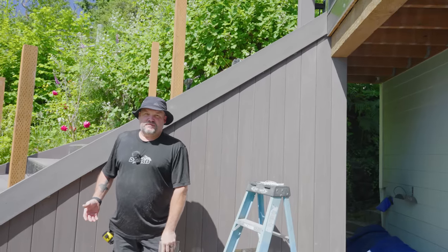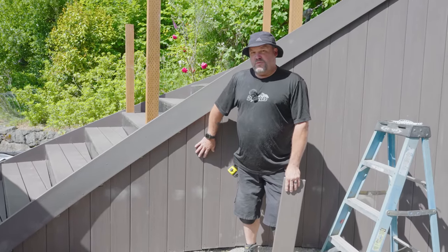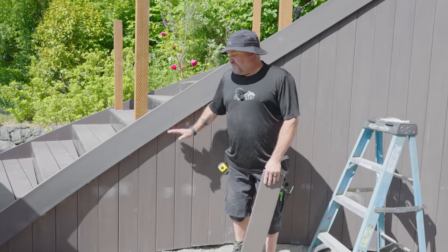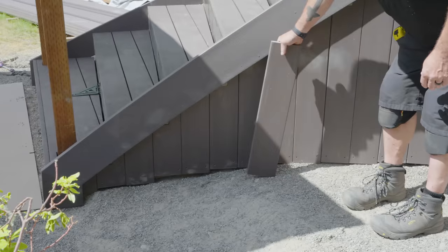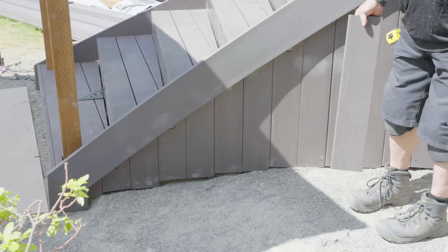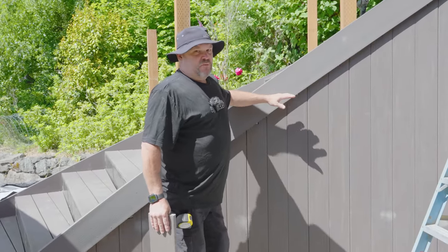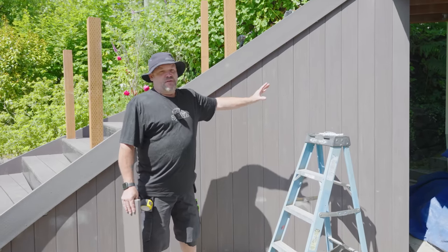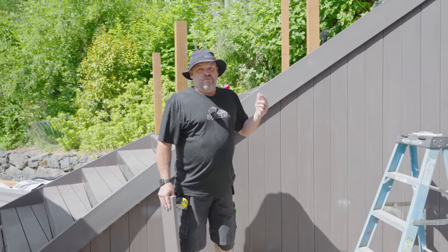You can see here we've built a curved staircase and the clients wanted us to hide everything — the framing below. So we have skirted this off. We're not completely done; we still have some more trim to add, but you can see the vertical skirting. We use a lot of these pieces as part of our skirt build, going all the way down to six-inch height pieces. From this level here all the way down was done in scrap. From here back was all cutoffs from other products we were using — either the deck, fascia, or other skirting cutoffs.